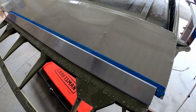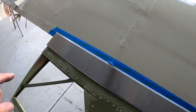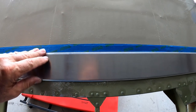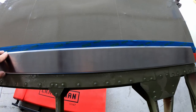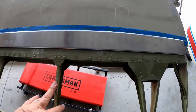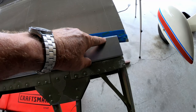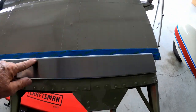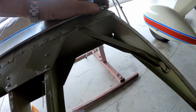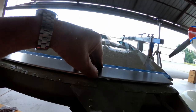After a lot of little bending, trying to get the radius right — here's my one-inch line, and here on the other end — the piece fits just fine with really no pressure pushing back. I think at this point it's ready for paint. I will drill the holes after the flap is actually covered and painted, because that will be the final fit. I want to mount the flap, maybe drill the top holes just to get it in position, and then use a thin piece of cardboard to make sure the flap moves as freely as it does now.